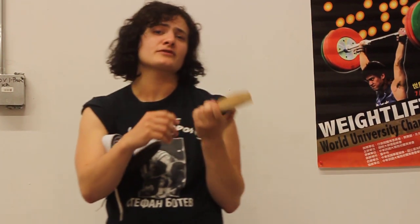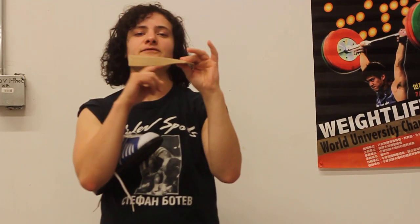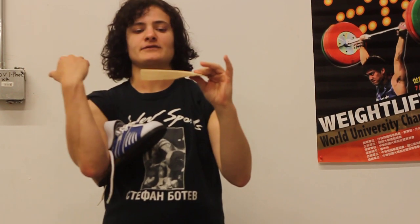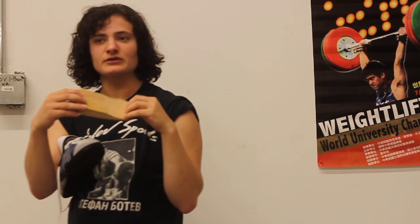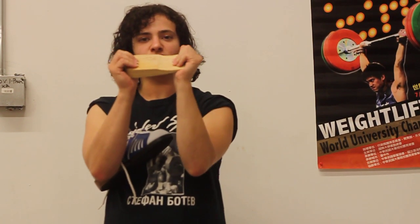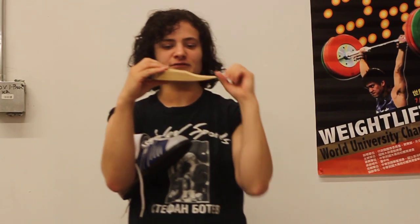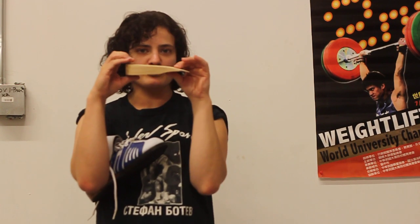Additionally, wood is a very interesting material. It's what we call an orthotropic material, which means it has a different modulus of elasticity along the three axes of the heel. When compared to other materials, it has superior tensile strength in bending — meaning you can bend this multiple times before it plastically deforms. Additionally, it also has superior compressive strength.